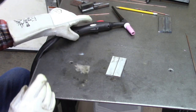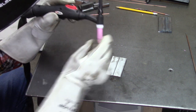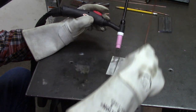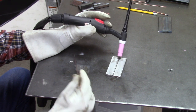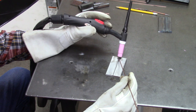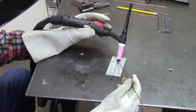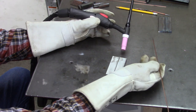I've got a couple of clean pieces — clean is very important with TIG welding — quarter inch by one inch, quarter inch thick steel. What I want to do is get a good pool of molten steel going, then just touch the filler rod into it, move ahead, wait for a puddle to form, and hit it again. Just like that. So let's give it a try.